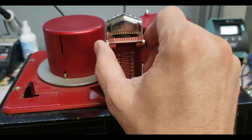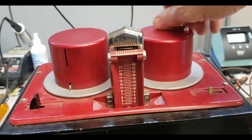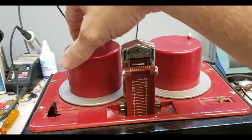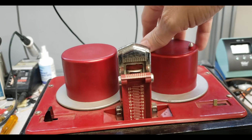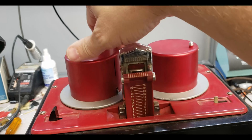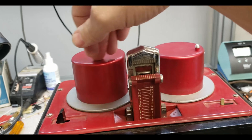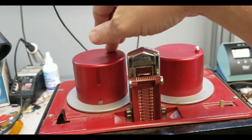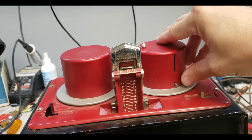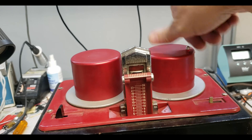Like I was saying in my other video, you would load the tape on here, pull this head all the way up, and then as it gets to the end of the track it bounces down. It's actually an auto-reverse mechanism — the tape winds along and as this gets to the end it bounces down, then reverses. There's this little lever here, and as it hits the end it hits a stop and bounces it down.